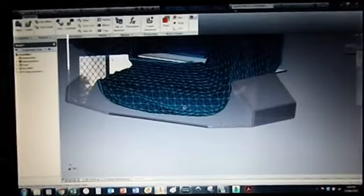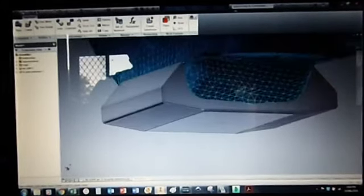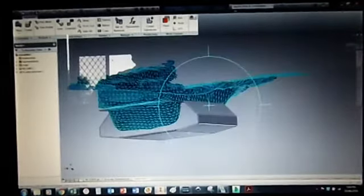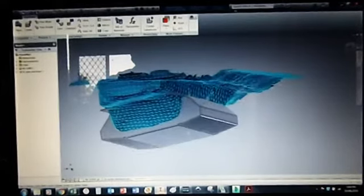And then I'm thinking I'll just put the sump plug on the front here. And putting it on the bottom would still be a bit risky. It's going to sit 10mm lower than the original one. Then obviously I can put some big dash 10 fittings in this side for the catch can return. And obviously on this side, which will be the turbo side, it'll have the drain already in the block.